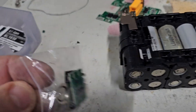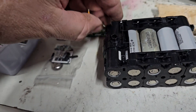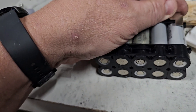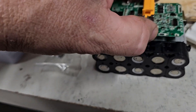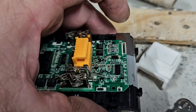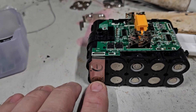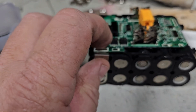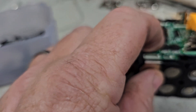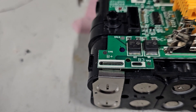I'll have a look for the other bit — maybe that'll help me. That one goes to the back I would believe, you might even go to the other side, but that would make sense. You can see it's got the indents — that's got to go in and you've got your connector on the top so you can solder that on. Just be careful when you're doing that because there's not much material to solder onto these things.